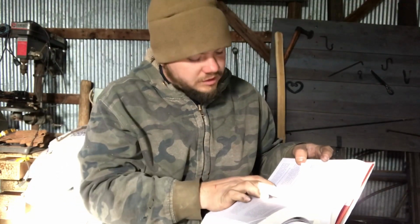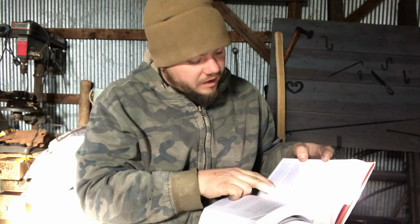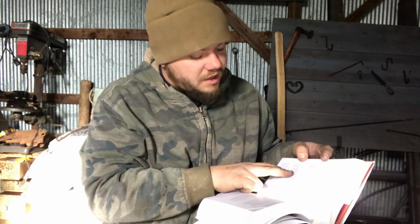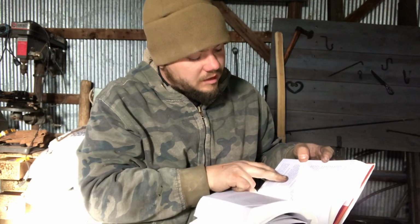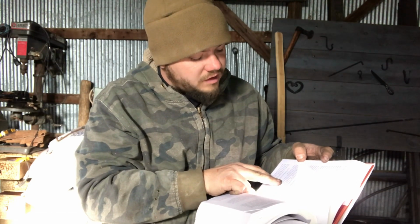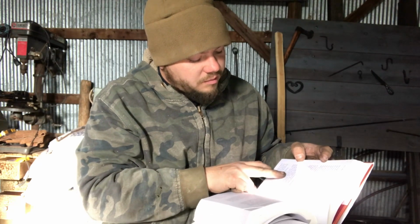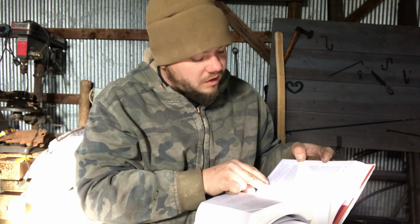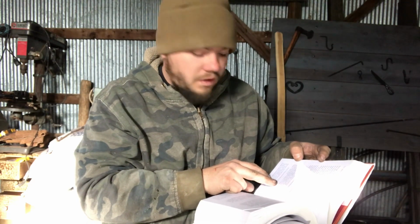Case hardening steel or iron. I think the best and simplest method of case hardening iron is to use prussiate of potash, the yellow prussiate that was in our kosher salt. It is a yellow substance that comes in the shape of flaky, shining flat lumps. Pulverize it until it is fine as flour. Heat the article to be hardened to a deep red and put on the potash just where you want it to be hard. Then put it back in the fire, heat it to a deep red, and plunge into cold water.